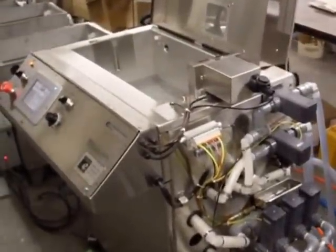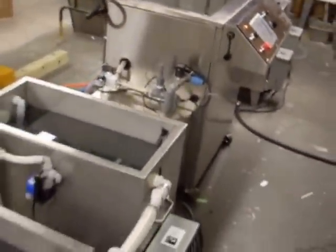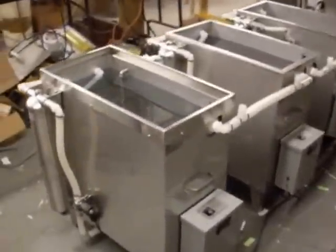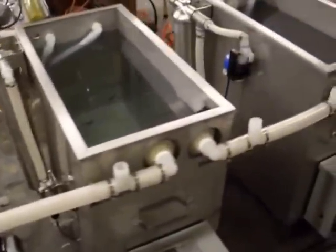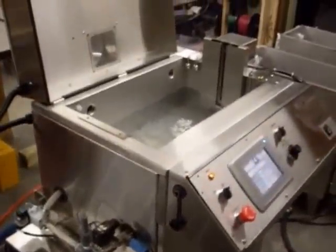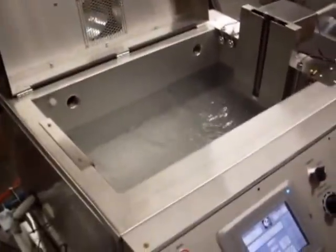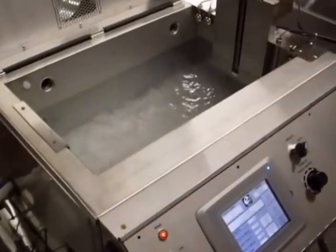You can see the air valves and some of the air lines. The tank is filling — approximately a minute and a half. On the side of the unit there is the pH circuit for detecting pH and conductivity. This system has three rinse water storage tanks — that's the third tank — and they cascade to each other with an initial, a secondary, and a third rinse tank. We're just about full in the process unit from the alkaline storage tank.